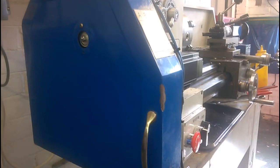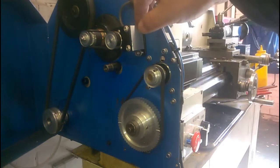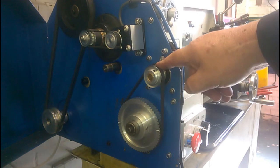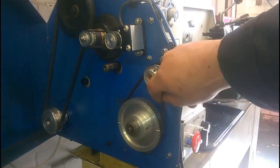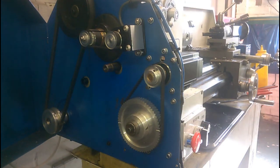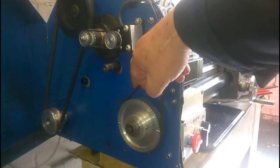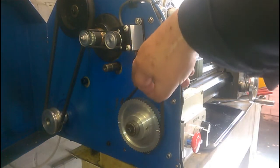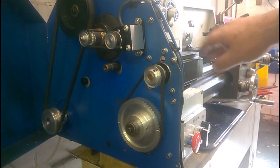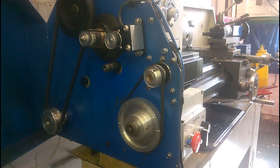Have a look under the bonnet. I've replaced the encoder mounting one-to-one again with the spindle. The servo is mounted and there's very little slack — I think that'll be alright. Bearing in mind that backlash is not a problem, if it appears that it is, I will put a jockey wheel mounted on a roller bearing on a sliding mount just to take the excess play out. I'm quite happy with the servo mounting, although the magnets may pick up some metal dust. I'm trying to think of some way to shroud it — if only I had a 3D printer.